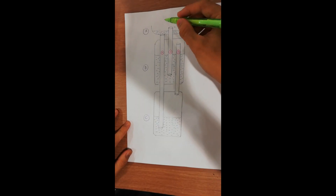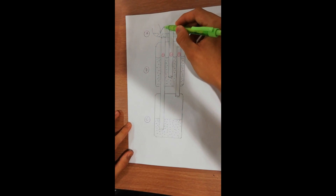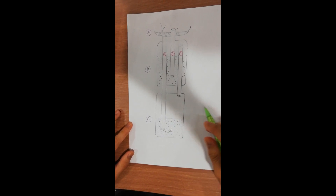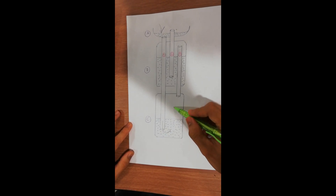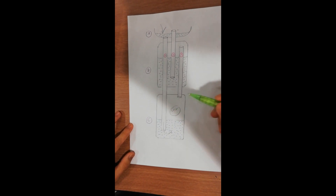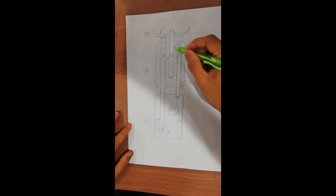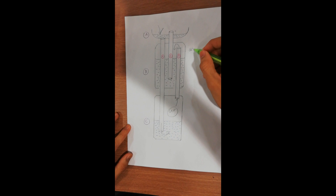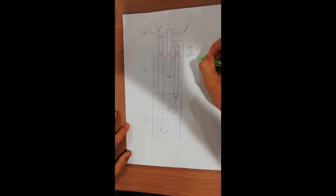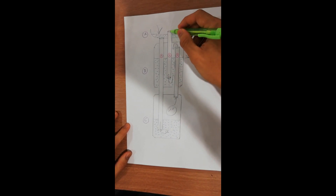After the startup procedure, we pour water into container A at once. The water will flow into container C. The previously filled water will block the air in containers B and C from the atmosphere. As containers B and C are connected, their pressures are the same. The water flowing into container C thus increases the pressure in containers C and B.